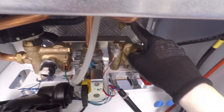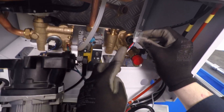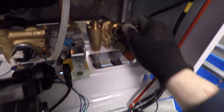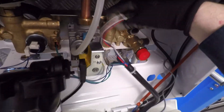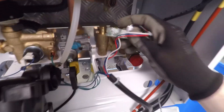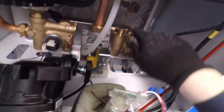Push the return pipe out of the way a little bit so we can get our socket on the top. Now, the hall effect sensor — it's worth mentioning that the wires go in from the bottom. Because if you've had it dangling down for a while and you're cleaning your O-rings or changing and greasing them, you might accidentally put it on the wrong way. It does fit upside down, but then the wires would be going in from the top. The hall effect — that little black square there — would end up in the wrong position. So wires in from the bottom.